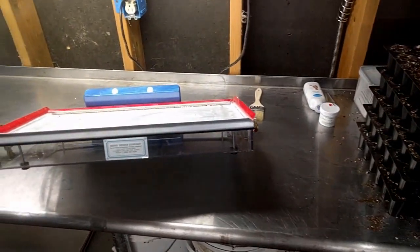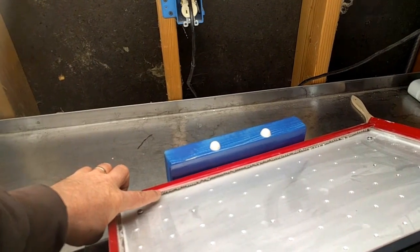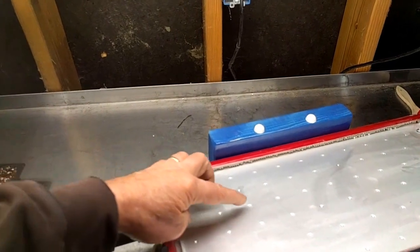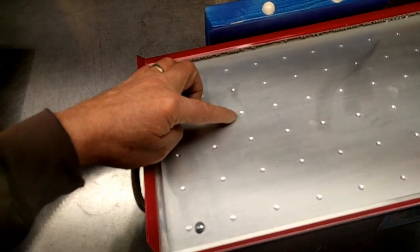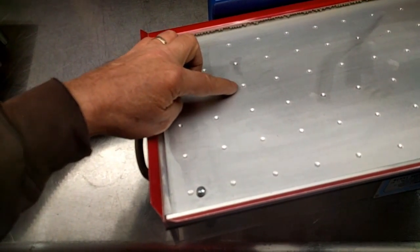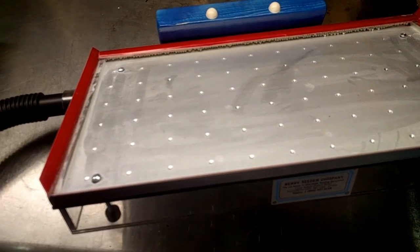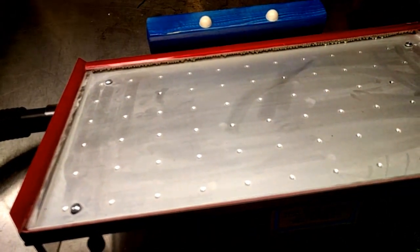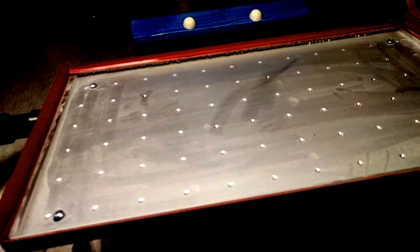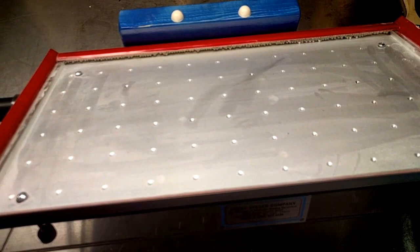And yesterday I used this for the first time. I'm going to use it again. There's a little U-shaped trough at this side of the vacuum seeder, and right in there right now is pelleted seed. And these are little holes that the vacuum will create a suction and hold the seed. Now this happens to have a little dimple in it as well. That's for the pelleted and large seeds. The rest of my seed flats, they look like the tiniest holes. Actually, when they sent me the plates that go on here that are interchangeable, I thought they sent me some that weren't drilled yet. And they're such tiny holes for the tiny seeds that we have, like the brassicas and all.